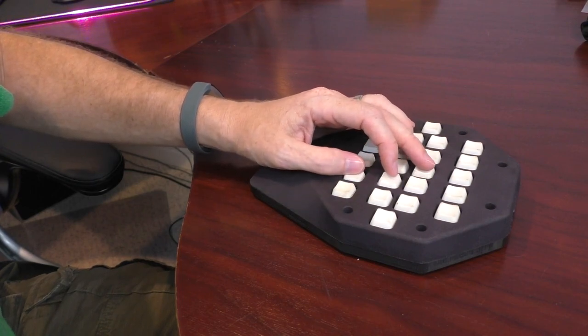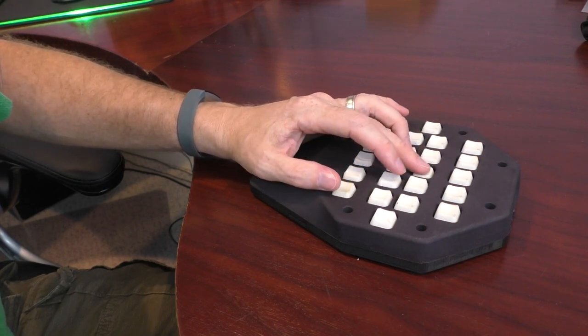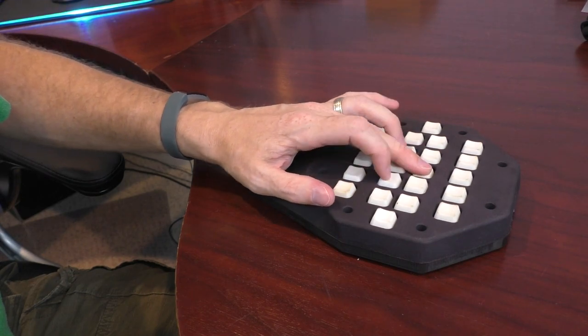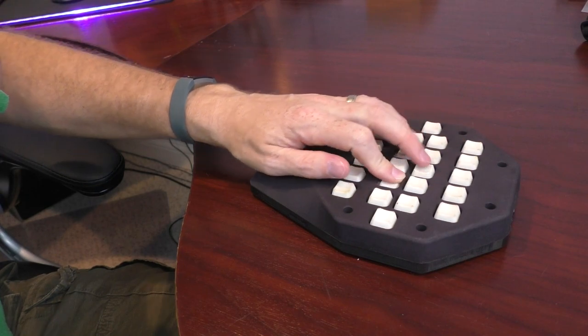The caps were measuring distance based on how far down you pushed them for analog movement, but the caps had a fair amount of wobble on the switch. Unless you hit it right in the middle or right at the bottom, it wasn't going to provide consistent performance. You could push in one spot and moving your hand around gave inconsistent results. We knew this at least gave a visual impression we were on the right track, but we were totally wrong to launch a Kickstarter.